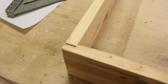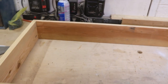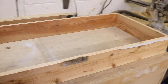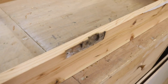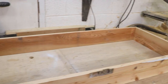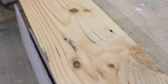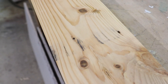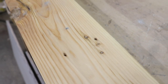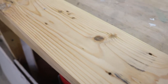I got all the boards notched now, and with the notch I'm just going to air-nail them and glue them together. The frame is pretty much exactly the size it needs to be, with the exception of some trim that'll go on the outside which will hide the rough edges. I pretty much got the nicest face of these boards done. The thing I want to do before I nail all this is — there are all these nail holes that are not going to look pretty. They'll be harder to get to once I put the frame together, so I'm just going to go around, fill them all up, let them dry overnight, and tack it the next morning.